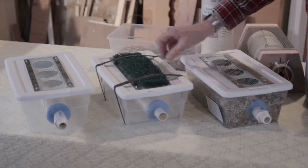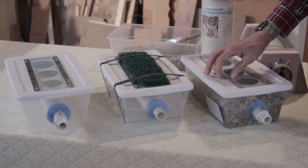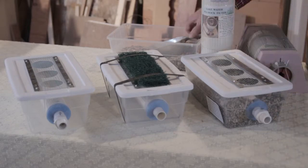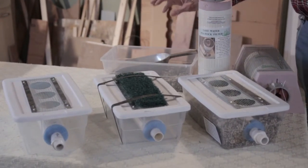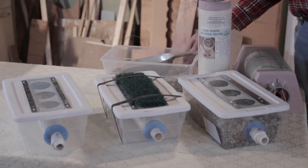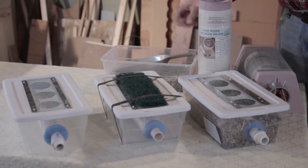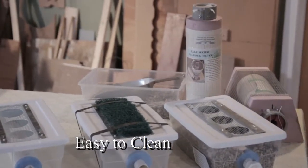So that makes a good filter, probably better than the ones you can buy in hardware stores like Menards. Those are pretty simple — this is a little more complex and probably better. I think so, because you can clean them. You just take out the pea rock. You want the pea rock to get the sand out of it if you buy it at a gravel yard — it's about quarter inch, and that works. That's the big filter part. But if it gets clogged up with stuff, you just dump it out, clean it, and put it back in. So it never wears out — that's one advantage over other filters you can buy.